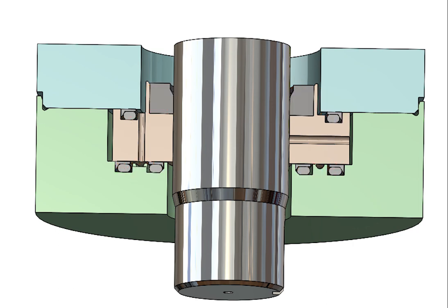To prevent cross-sectional twisting of the backup ring, the rotary seal is axially offset with respect to the face seal. This slight axial offset provides a slight pressure imbalance acting radially outward. This slight imbalance creates a countervailing torque that counteracts the torque caused by radial misalignment of the axial hydraulic forces.